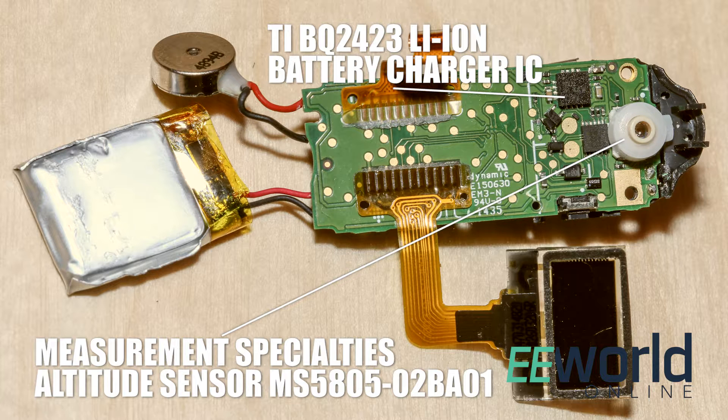The sensor module includes an ultra-low power 24-bit analog-to-digital converter. But there's a chip right next to it that's a bit of a mystery. We generally use markings on chips to figure out what they are, but in this case the markings aren't definitive. One clue is that the chip sits very close to the altitude sensor, so it could have something to do with altitude sensor readings. Also, a close look at the circuit board reveals a connection from the chip to the side button you push for getting readings, and another connection from the chip to the TI battery charger IC. So you might conclude our mystery chip probably has something to do with the readouts of the altitude sensor.